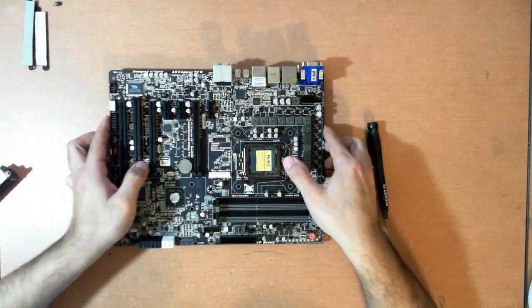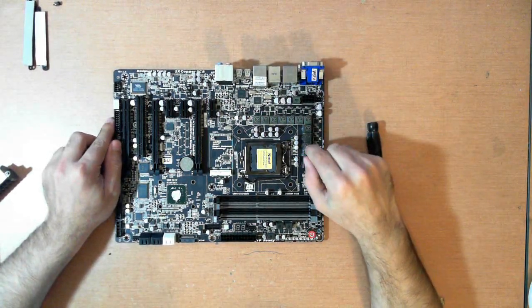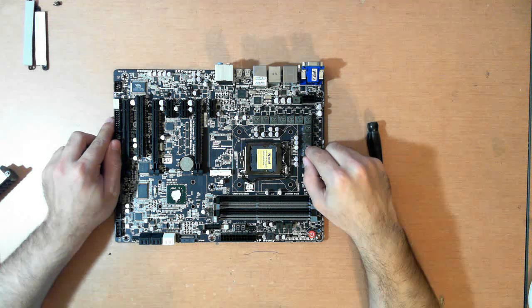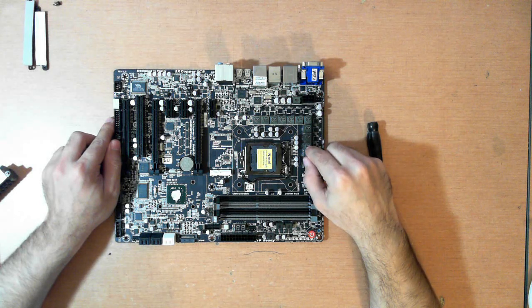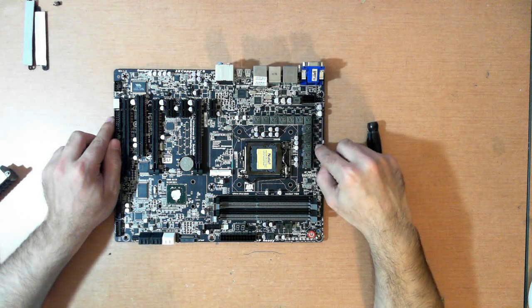Because I do believe other manufacturers will adopt this, because currently this is the ultimate solution. For the first time, Gigabyte has leading power delivery design in the same phase quantity, and they're kicking ass. You cannot make an 8-phase power design without these chokes and these MOSFETs and claim 60 amps per phase.